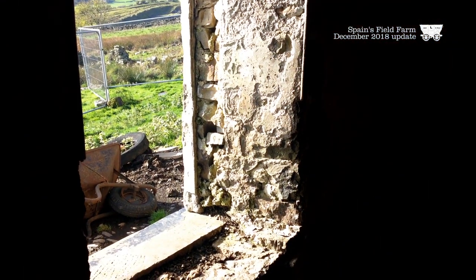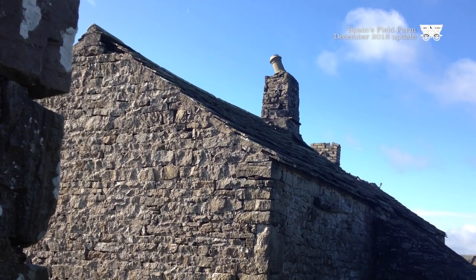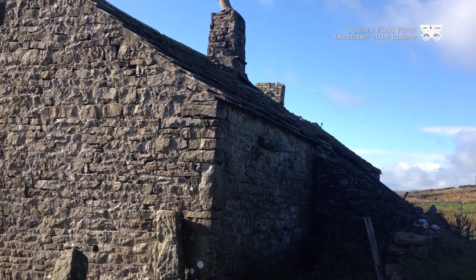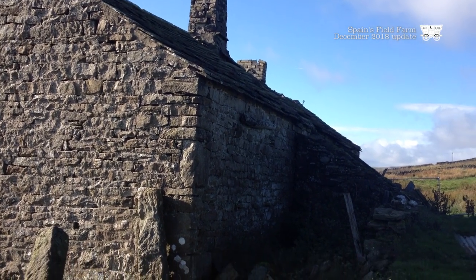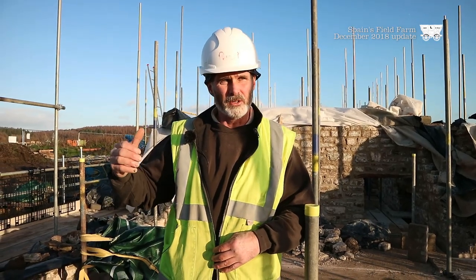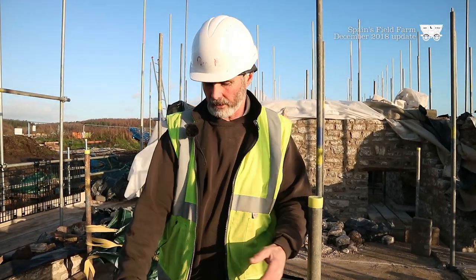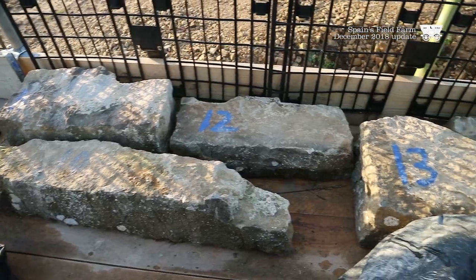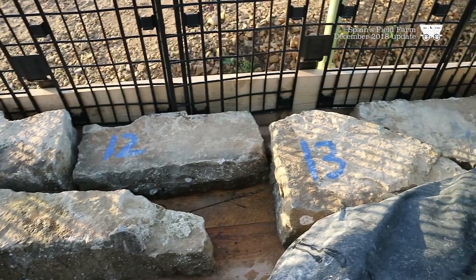So we are actually building it back the same way. You'll still see various straight joints where buildings were butted up against each other when we finish it, and we'll try to retain that on the way back up. All the lintel sills and heads will be going in the same places, and the stone will be going in. As you can see, there's numbered stone here for certain courses, but the stones will be going in the vicinity of where they came from. Obviously it's not all individually numbered.